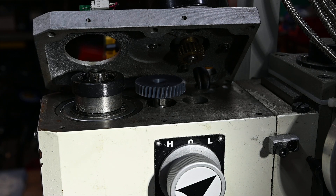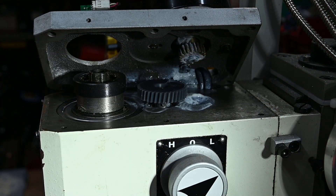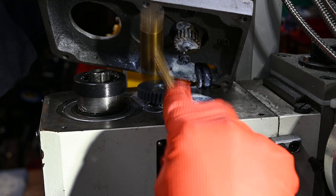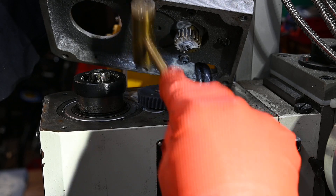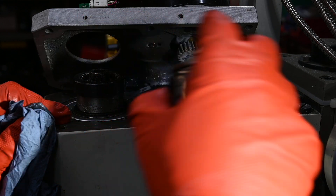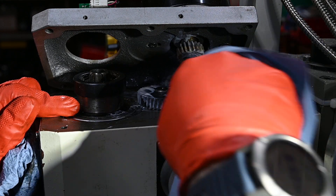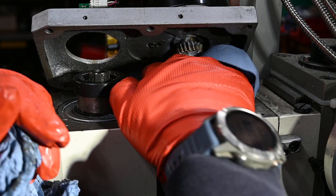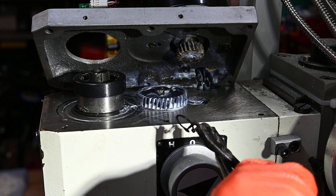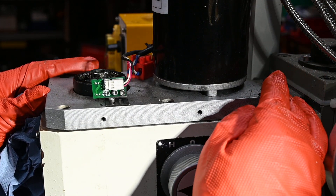I'll have to get some grease in there. I've got some lithium grease in there. Get rid of some of the surplus. Just a case of getting the circlip back on now, and spin that round so that's opposite that. Let's see if that's stopped that horrible granching sound now - give that a bit of a test.